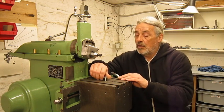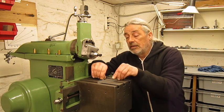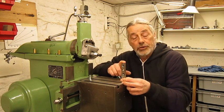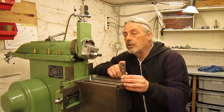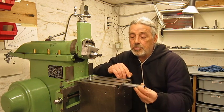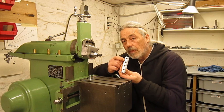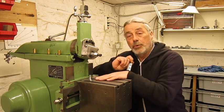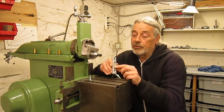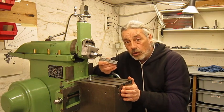If you make T-nuts like this, always beware that the top surface of the T-nuts must be lower than the surface of the table — otherwise completely pointless. In the book it may say that T-nuts should be hardened. In industrial workshops, maybe that's a good idea. But I think for the home shop it's not a good idea. If you have chips interfering with your T-nuts, they will make imprints in the T-nuts. If the T-nuts are hardened, they will make imprints in the table, and you're going to lose the precision of your table. If the T-nuts are not hardened, after a few times the threads will wear out — but that's not a problem. If they don't work anymore, make new ones.